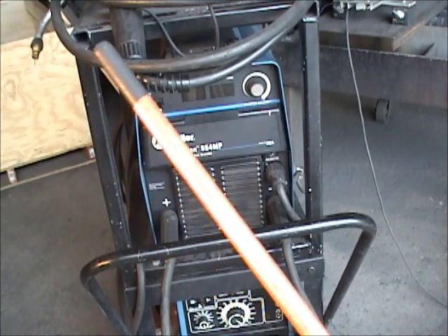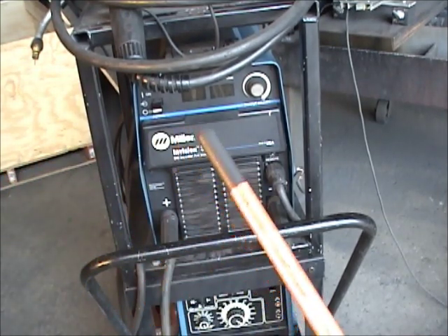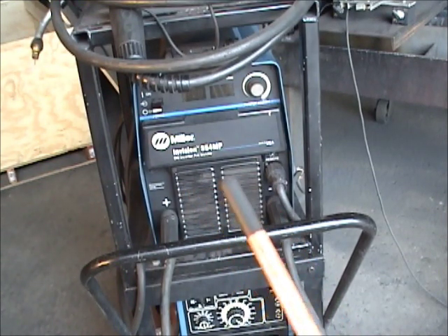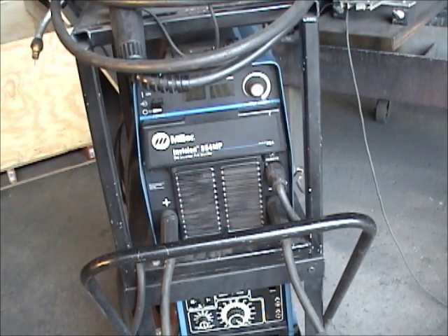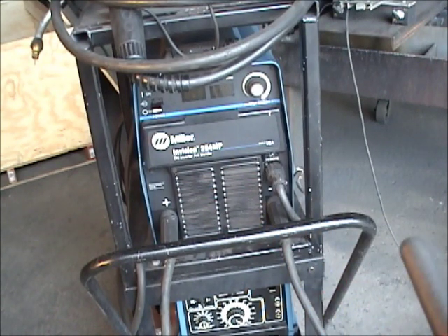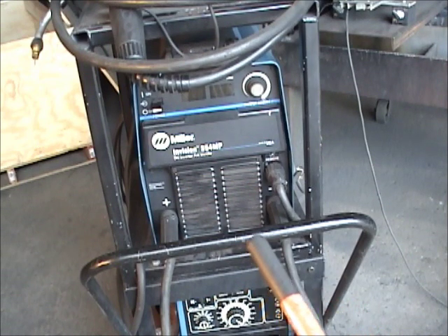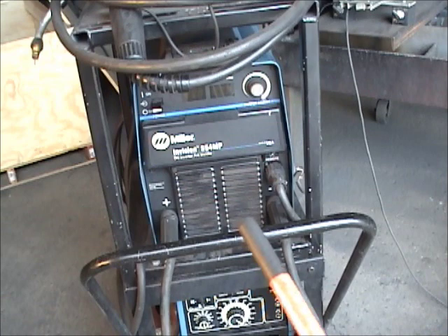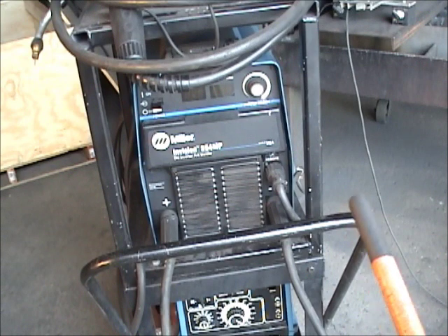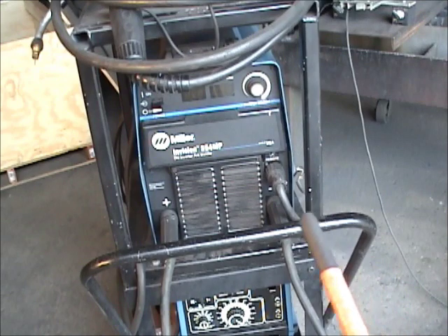This machine in general is going to make a lot of noise. We're going to be using compressed air, and we're going to be using two power sources maxed out. This process will remove quite a bit of material. It is ideal for removing bad welds, ideal for putting in a bevel or a U-shaped groove on a weld. It'll do cutting and can cut through something — that's a little trickier process — but it really is designed for gouging and metal preparation.